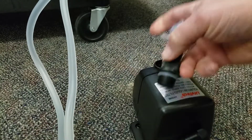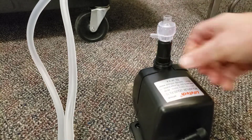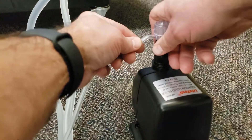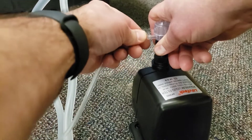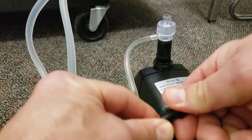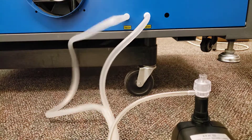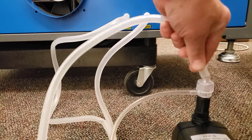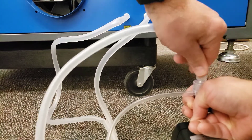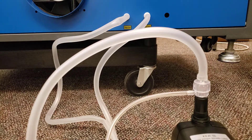I'm going to tighten that back in and attach the tiny hose, which I'm assuming allows you to vent — I haven't seen this listed anywhere and I'm assuming it'll be locked off unless we want to let air out. Then make sure you've got the one that says water inlet, bring it across, and simply attach it. You want to make sure it's snug, because if you don't have water going through chilling your laser, that's going to be a catastrophic failure.